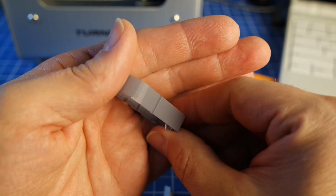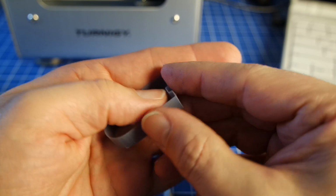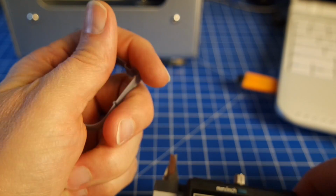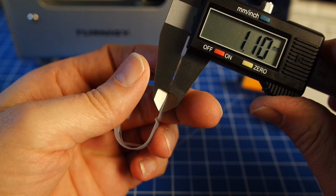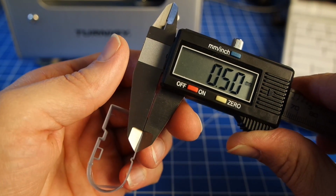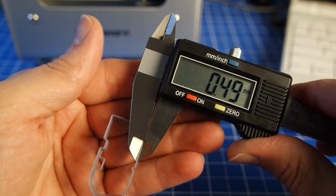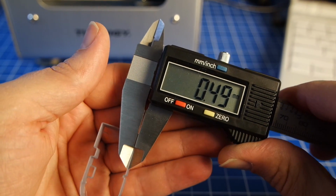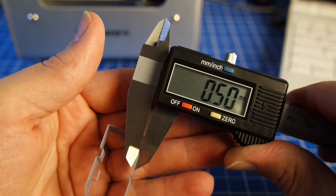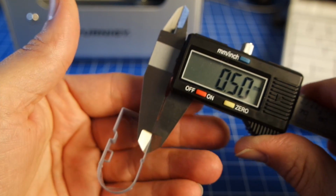The surface quality looks very good. So do the edges. The extrusion width should be about the width of the nozzle, plus a little extra for over extrusion. The nozzle width is supposed to be 0.4 millimeters, and that's about 25% over extrusion. That is quite good.